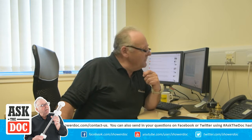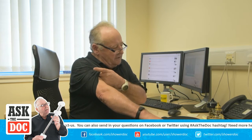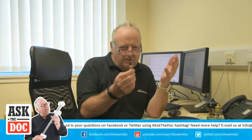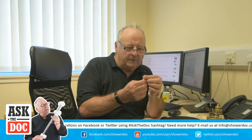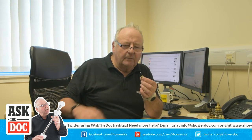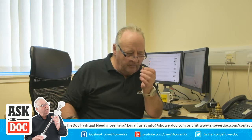Lucas has posted the YouTube video on how to test the shower thermostat. One other thing to look for: sometimes you'll see that the wax has come out around the bottom area of the thermostat — that's a sure sign you need a new one. Otherwise, it's not really possible to check without doing the hot-and-cold-water cup test.